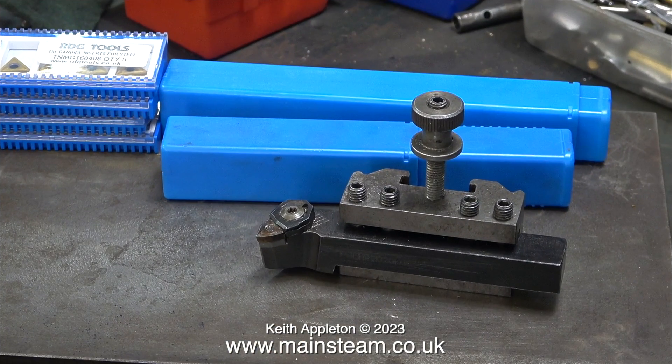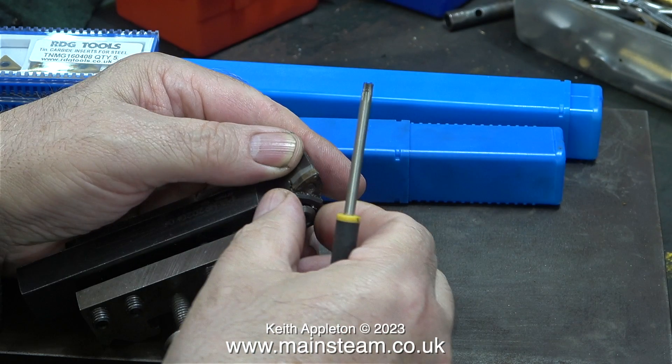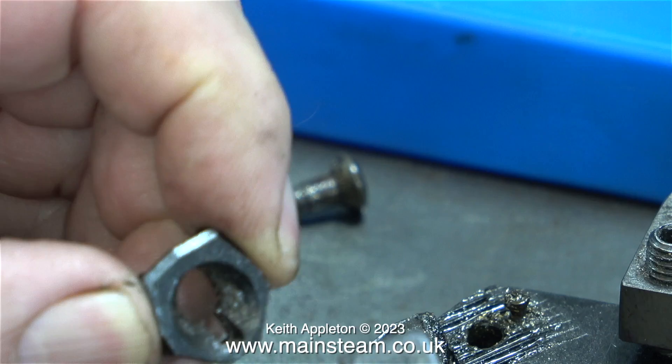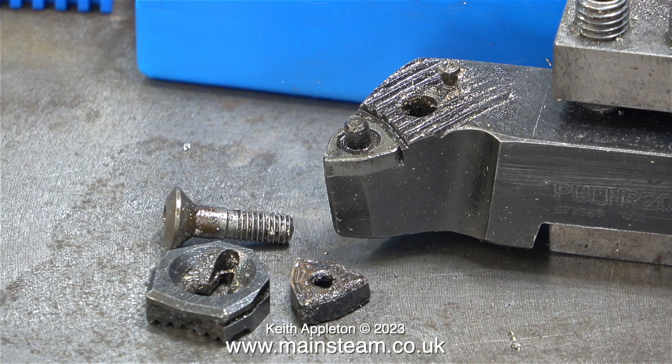This video is primarily about carbide tip tools with replaceable tips. This particular tool is a bit special — using my milling machine, I mill some off the bottom to make it a bit slimmer, and this allows me to use this tool both in the Boxford lathe and the Smart & Brown lathe. In this clip I'm removing the old carbide tip, which has got down to its last sharp tip, and even that's not very sharp. The tool tip is held in place by a clamp, and it's all very clever — the countersink in the clamp and the countersink of the bolt makes sure that the clamp is always in the right place.